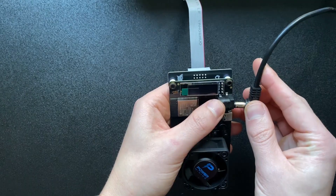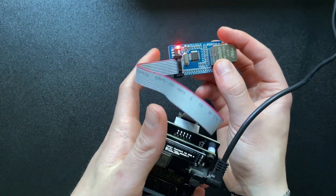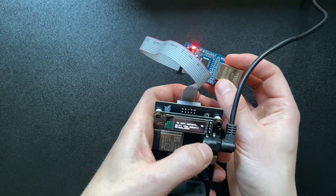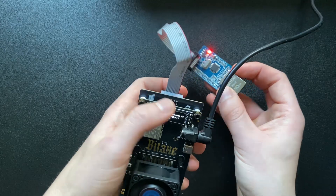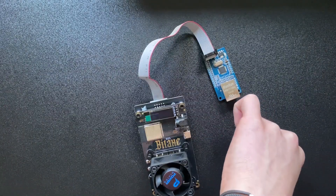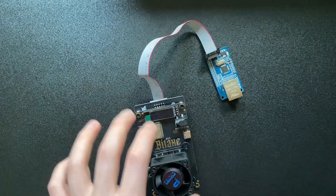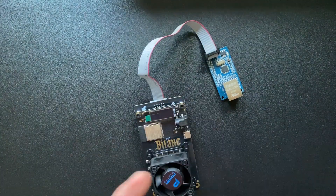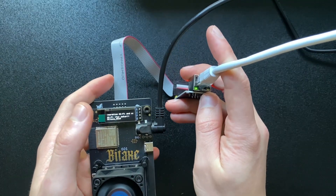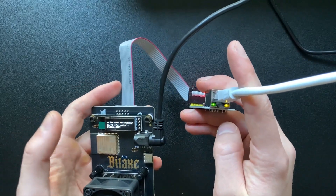I'll show you an example of what it should look like when you plug it in - this applies the same for the nerd qaxe. What you need to see is the red light on the LAN port. This is currently defaulted to Wi-Fi mode, but let's get it set up. I recommend plugging in the LAN port first and then powering it on, as that seemed to work better than powering on first. Once you plug it into your router, you need a green light and a flashing amber light - green means you have a connection, amber means it's actively sending information.